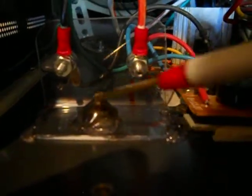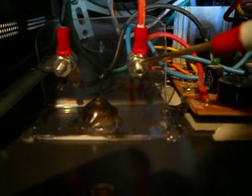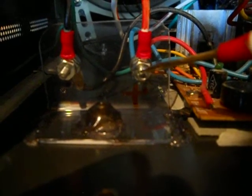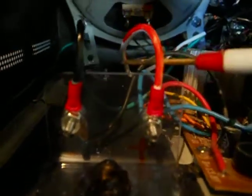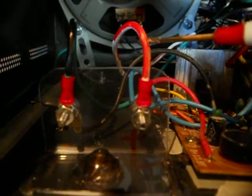This is the bolt that holds it down there and it's completely covered in glue. You would never want to be in here doing something and short back to the cabinet. I've got extra-long bolts on here because I have to add the fan, and then in the future I'll be adding the ability to hook a 12-volt car battery to back this power supply in case of a power failure. I'll have a switch on that wire so the juice cannot back-feed into the power supply, because it will — I've tested that before.